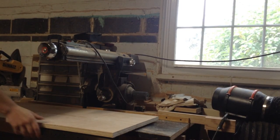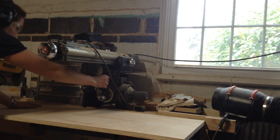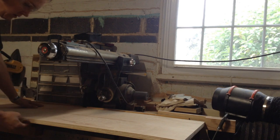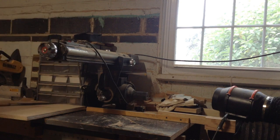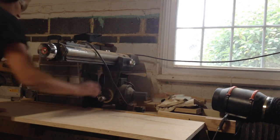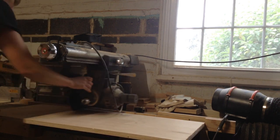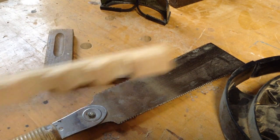As you can see in the video I was cutting my pieces down to size. The bottom of these cabinets were about 18 inches deep when all was said and done. I had to account for the face frame going on the front so I made these a little bit thinner, and as you can see on the radial arm saw I'm cutting these down. I was just shy of being able to cut these with one cut, so I'm going to have to flip them all. On the bottom there's going to be four cabinets with two drawers in each one.